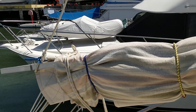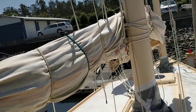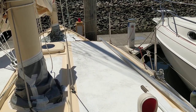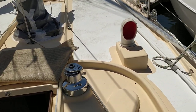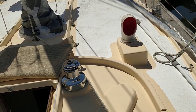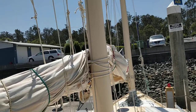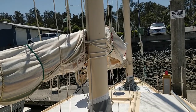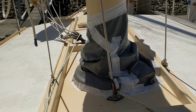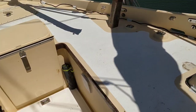The sails are brand new — they've only done the one trip. The battens I've used aluminium poles because they're nice, strong and rigid but also lightweight. I think it's the equivalent of the new bamboo. The good thing about a junk rig is that you never have to leave the cockpit. You hoist the sails from here, you sheet in from here. You can have extra bits and pieces like yard hauls and batten hauls, but I just have a halyard and a winch. I sailed around on my other junk rig schooner for years like that and I hardly ever used the others — just had too much rope in the cockpit. So I just go with a very simple setup and it seems to work very well.